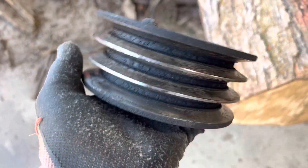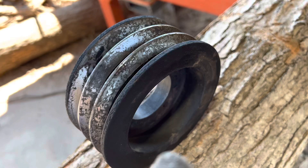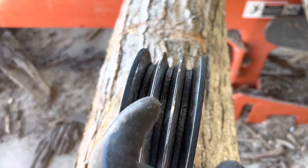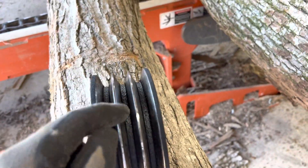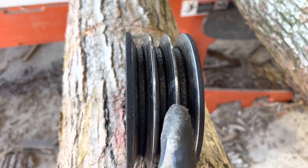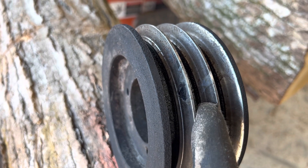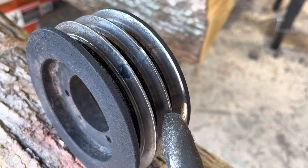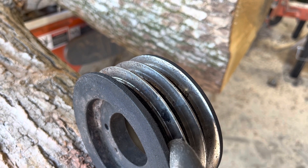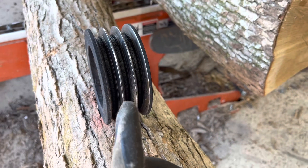This is that pulley. I let a little bit of rust get on it because I had it sitting outside — it didn't have that on it when I took it off. In these ribs right here, on a new one the middle bars are a lot thicker. Your belt rides right here and spins around that — that's the little bitty pulley. Now if you look, you can see where it's worn. See that line in that pulley right there? There's a ring line — see it above my finger? You can see it on this one even more. That's where that pulley had worn all the way around that ring on both of them, not letting it grab as well. And when I changed that pulley, it made a world of difference.